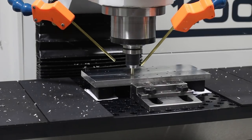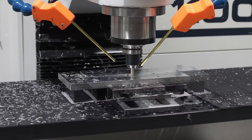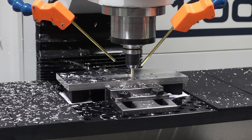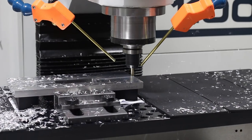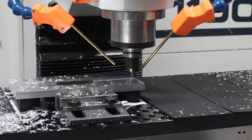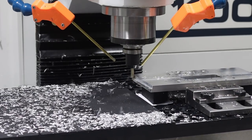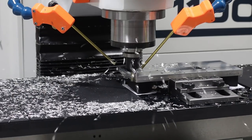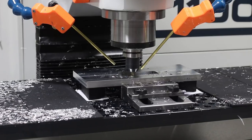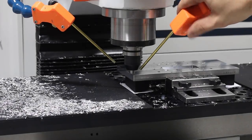Now in the center of this plate we have a large rectangular hole for chip evacuation — probably going to go with a vacuum directly hooked up here to really keep things clean. So we'll come in once more with the quarter-inch 3-flute end mill and a 3D adaptive toolpath to clear out the bulk of this hole, as well as take care of this extra material along the saw-cut edges before finishing up the profile with contour. Lastly for this op, we'll throw a chamfer on it, then flip the part, face and chamfer again.